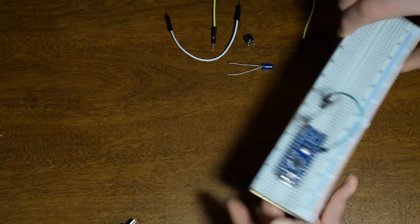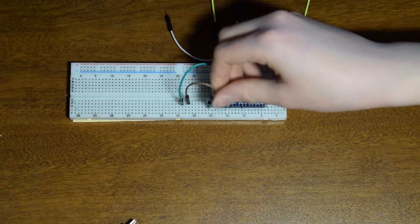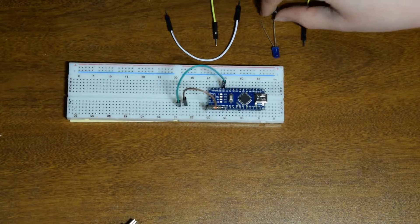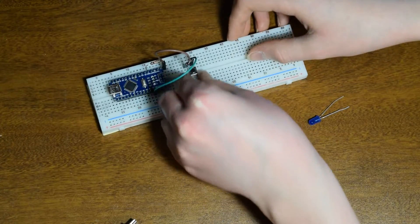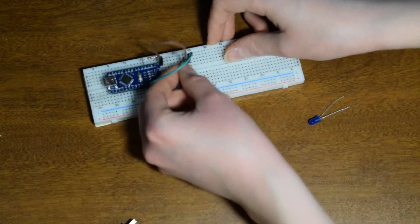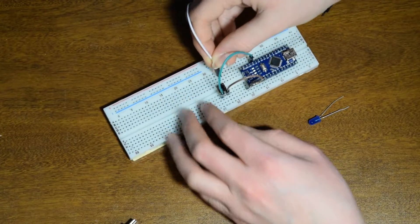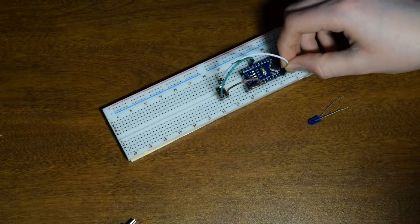The basics of the circuitry would be having a button run from 5 volts with a 10k pull-up or pull-down resistor from the ground, and then you will want the button to connect between the 5 volt and ground lines. So basically it will bridge over the IC valley per se. We'll connect the output from right here and that will go into a pin that you can later specify — right now I'll want to have it on D5.